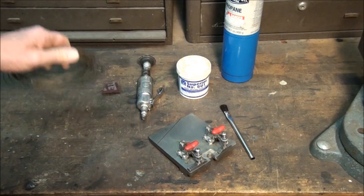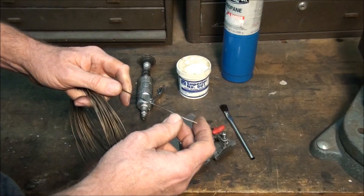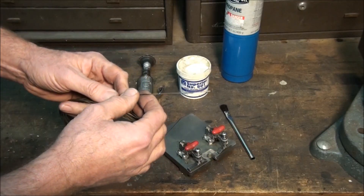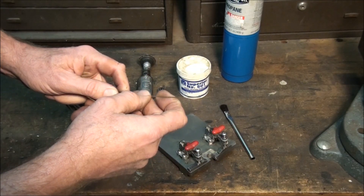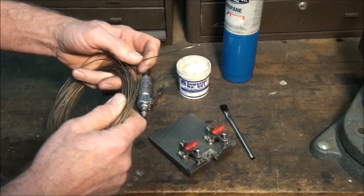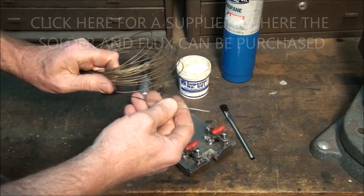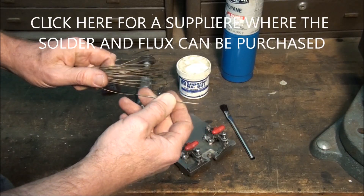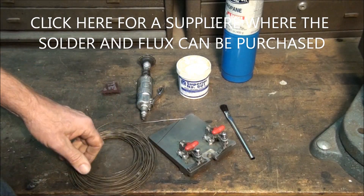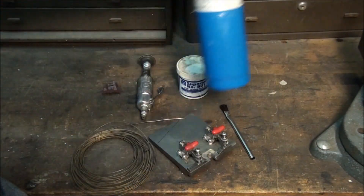Another thing you need is silver solder — hard silver solder, not the stuff you get at the hardware store. I know they call it silver solder but it's really not. You need silver solder that's at least 50% silver. At 50-56% silver it's going to melt at about 1150 degrees and be really strong — plenty strong for a bandsaw blade. This rod I have is a little thicker than I like at 50 thousandths; if you can get around 30 thousandths diameter it's even better, a little easier to melt. Unless you have oxy-acetylene, I'm going to show you how to do it with propane — everybody has a propane torch.